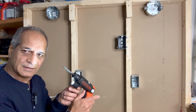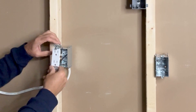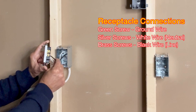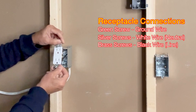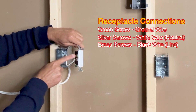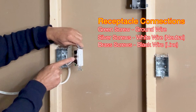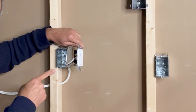I normally use my Black & Decker cordless screwdriver — it is a handy tool. We have a black wire which brings in power, connected to one of these two brass screws. On the other side, we have the white neutral wire, which is connected to one of these two silver screws. The bare copper ground wire is connected to the green screw.